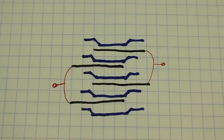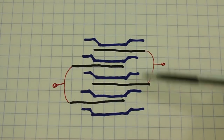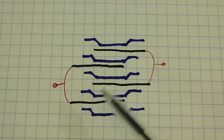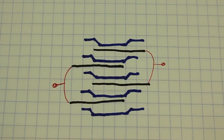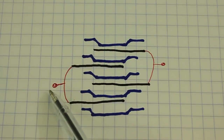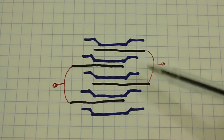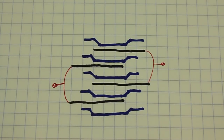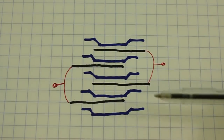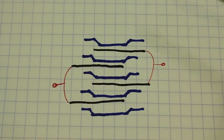This is what it looks like if we add a second layer. In blue we have the disposable dishes — we have five of them — and in black the aluminum plates. We will interconnect 1 and 3 to form one terminal of the capacitor and 2 and 4 to form the second terminal. If we add a third layer we will interconnect 1, 3 and 5, and 2, 4 and 6, and so on if you add more layers.